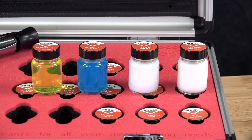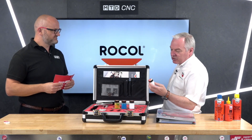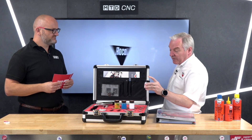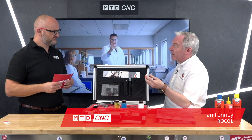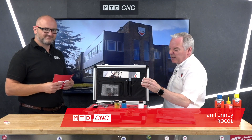One is a multi-purpose — you would use this in a lot of the oil and gas industry, so in Inconels, stainless steels, but it also does aluminium as well because it's got a bit of a lubricity package in there. But sitting right next to it, looks very similar, this is purely for aluminium — so this would be for somebody who was just machining solely in aluminium normally.